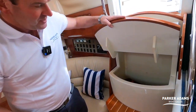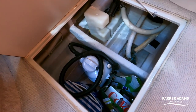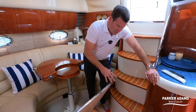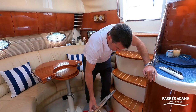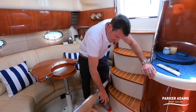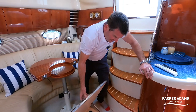There's always somewhere to store things — there's a little cubby hole with life jackets in there. There's also access to the bilges and the seacocks for the toilets. One thing I've noticed about the bilges is they're all bone dry — the engine bilges, everywhere I've looked — and nice and clean with no mold anywhere, which is a sign it's been very well looked after. The boat doesn't have a holding tank but it has vacuum flush toilets. These operate by creating a vacuum between the tank and the toilet — when you push the lever it sucks waste into the tank and pumps it out to sea. So these are sea toilets with no holding tank.